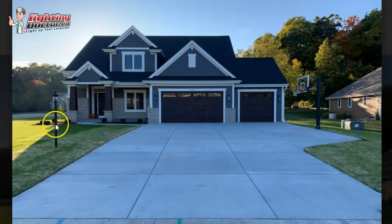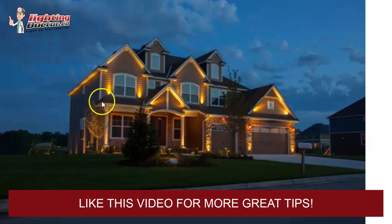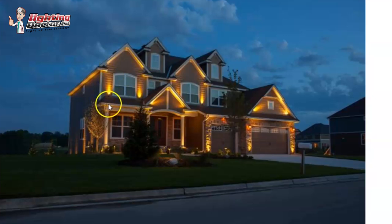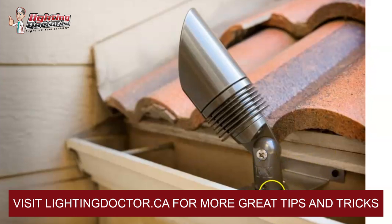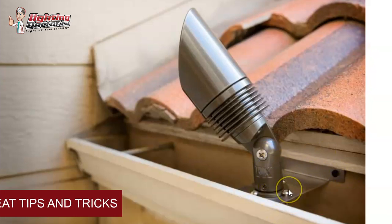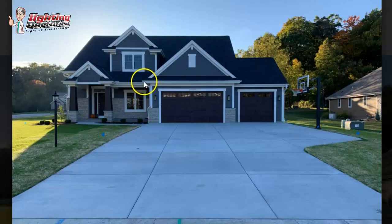That's what I would do in the front area there. I really like lighting the second story. Now in this case, they've got the lights right here, and I think that makes sense here because it's very steep — you don't want to light too much of the roof line, but you want to really take advantage of some of the second story peaks on your house because that's where you can really make a landscape design pop. We have something called a gutter mount, which is this little stainless steel bracket. It fits in the gutter, just screws in there. All our connections are waterproof, so you can make them right inside the gutter. I usually run the wire up or behind the downspout, then mount uplights that angle towards the peak.